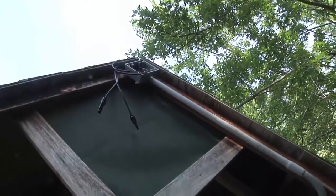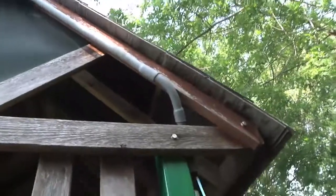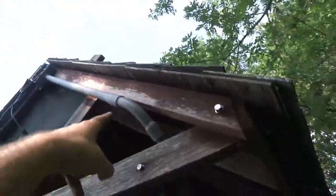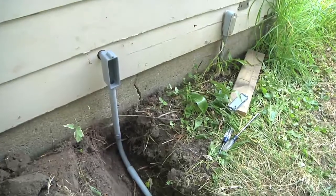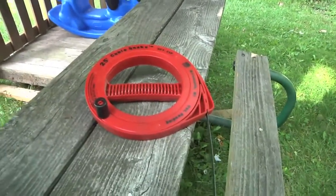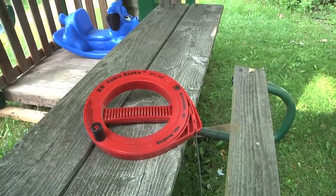Back on the playhouse, the junction box and the pipe out of it down to the corner — I got all that glued up. The only issue is at this corner right here, it's kind of a goofy compound curve to get around. So I decided not to glue this joint because I could make that a pull point — get the cable through there and all the way down. When I was playing around with the fish tape, it kept getting stuck there, so I'll do a two-part pull.